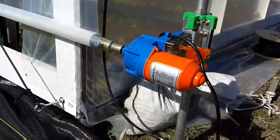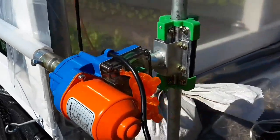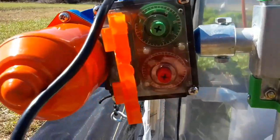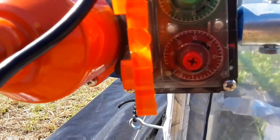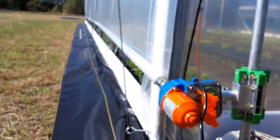I've mounted the roll-up side curtain motor to the curtain, onto its trolley, which is on a three-quarter inch piece of gas pipe. It goes all the way up to the top so it can ride all the way up. It's got some limit switches down here on the end that you can set. For my purposes on this side, the red's the bottom and green is how far it goes up.